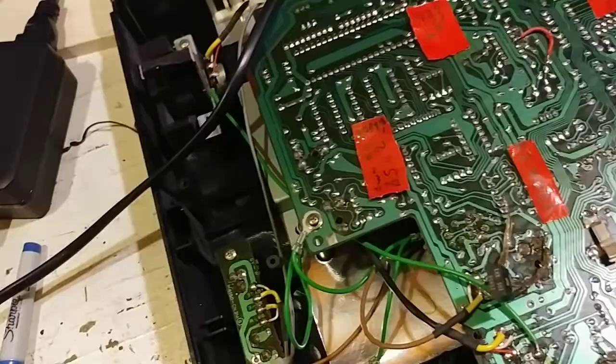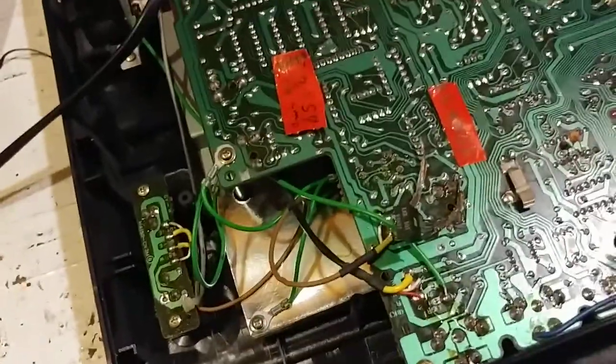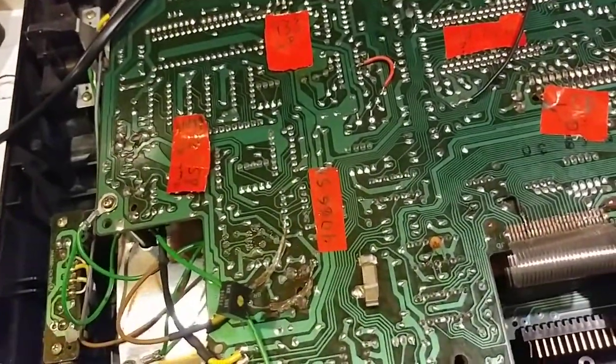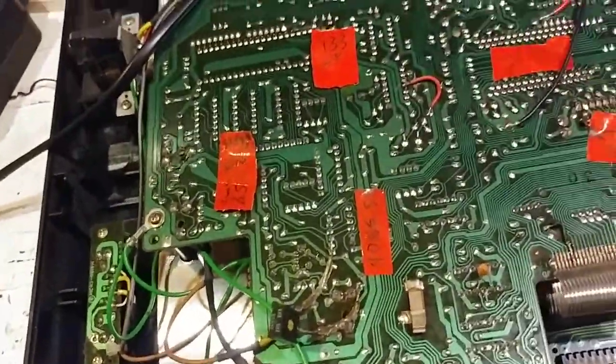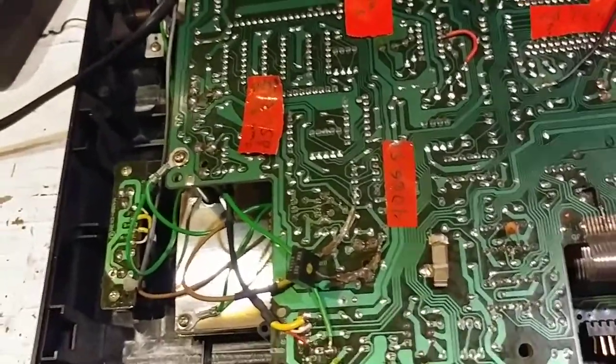People online say if you've got weird noise, adjust it. I adjusted and nothing happened. So I took some readings, and it's reading mega ohms on one part and 36K on another part of it. And it's a 500 ohm trimmer.